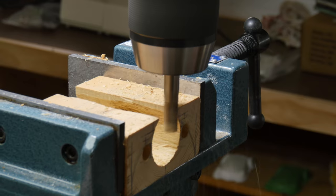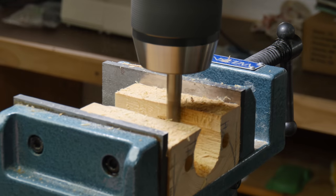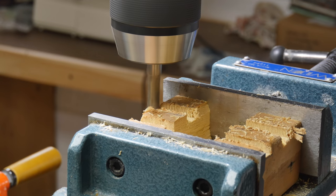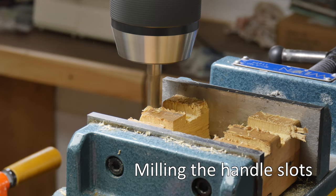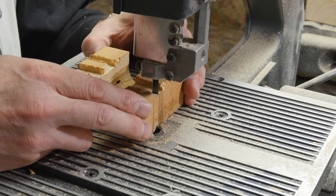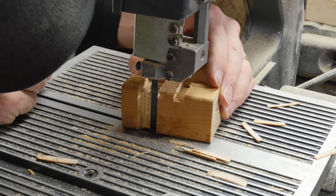The tangent on the side goes straight up, which is easy to do with the mill. Here I'm drilling the rest of the cross slots on the top — this is the big wide slot where the handle of the backpack actually goes. It's a lot wider than the slot in the back, which is used to hold your mobile device. The part felt a little flimsy, so I'm going to use the bandsaw to make a series of little relief cuts and remove that material.